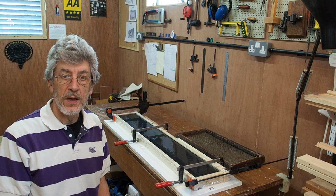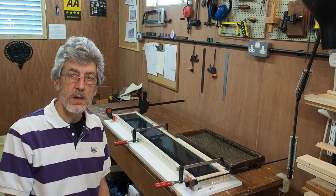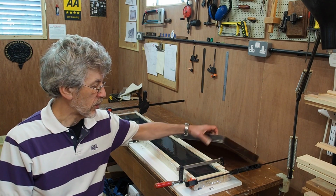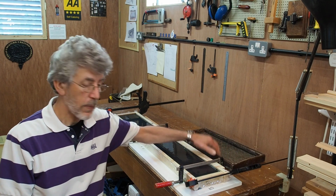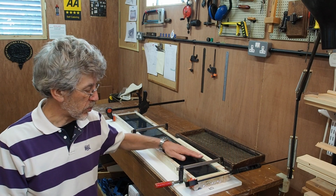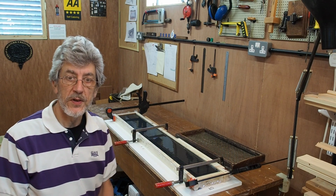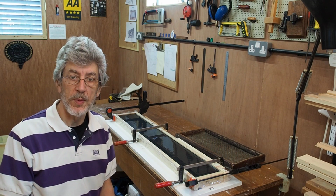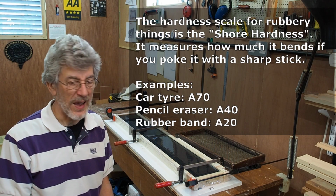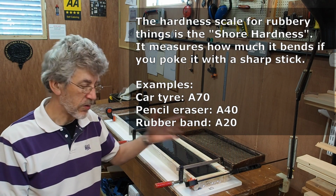One thing I have found out since recording part 1 is that the rubber that I used on the previous 2 moulds, this really quite firm hammerable rubber, is a different rubber to what I've used on this occasion. The old one is a 75/60 rated rubber. That produces a rubber on the A60 of the hardness scale. That's the order of a sort of soft tyre.